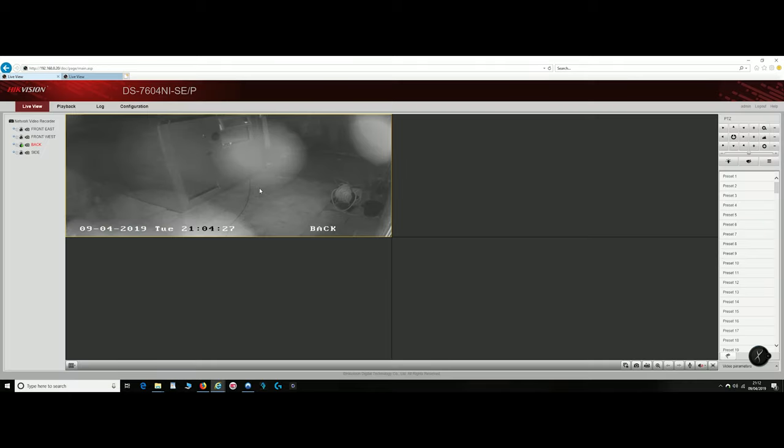and it'd be totally illegible. Now I have got, of course, some pretty good security lights, so if somebody comes round the back or in front anyway, they will turn on. They're so bright that it actually does turn the cameras back to daylight mode and everything's in colour. So basically I'm only using the infrared light for monitoring it when I'm not at home on my phone and things like that. But as you see, I've just turned them on in the house now and they've come on, and again you can see there I'm actually in a black fleece, although it looks white under the infrared. But you can see how clear and how bright them lights are, good enough to send the camera back to full colour mode. So I would get a pretty good look at the assailant's face anyway.